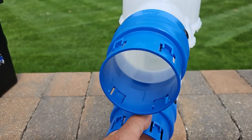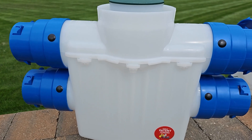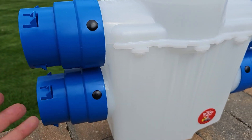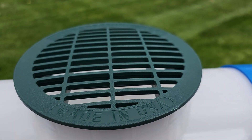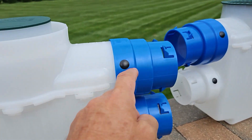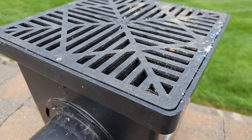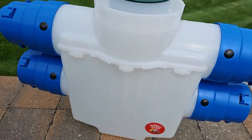That's why we went ahead and designed these catch basins that have these single and double. This one here is our 4-way — this is our Torrential Rain 4-way Connect catch basin. We just absolutely love it. You just slip on whatever coupler you need, whether it's 3-inch or 4-inch. If you need a 4-inch cap or 4-inch grate, a 6-inch grate or 6-inch cap — no problem. Do the math: 6-inch inlet for two 4-inch pipes. Why do you need 12x12? Not in a lawn. If you're going to pave this in the middle of a parking lot, okay. If you're going to put 6-inch pipe on it, okay. But I just don't get it. None of it adds up — none of it ever made sense to me. It just made work for me.